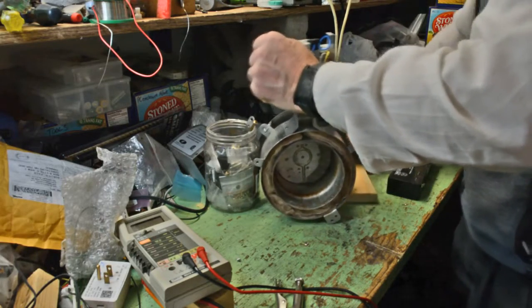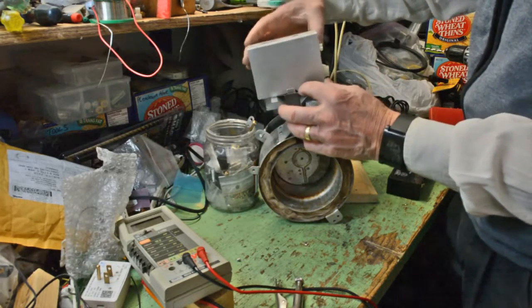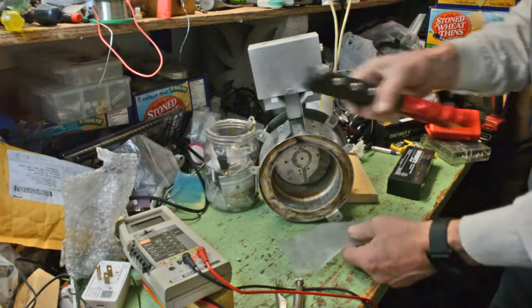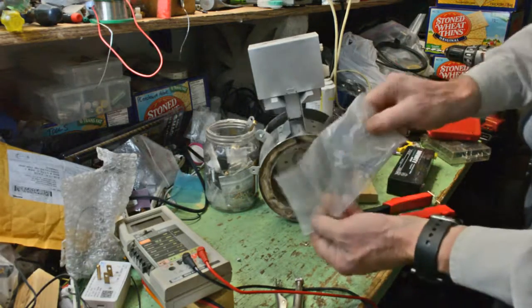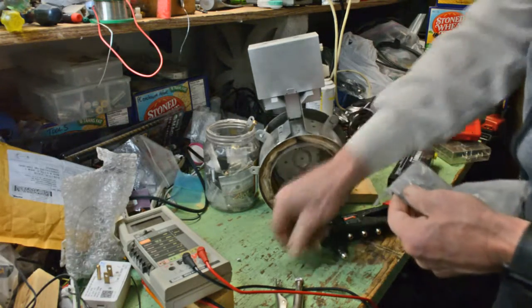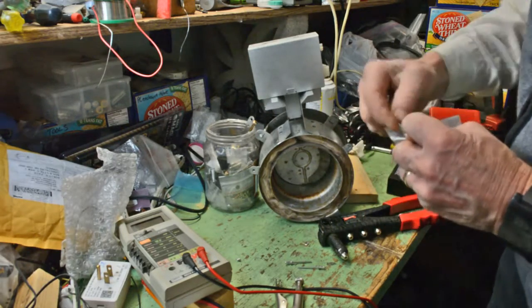See the 3 mounting tabs where it fastens to the top of the water heater. So I'm going to slide that on, make sure the tab is outside the cover itself. Pop rivets, I believe they're 1/8 diameter, maybe 3/16 grip range, whatever you want to call it. There's only two thin layers of maybe 28 gauge steel to hold together, so the grip range doesn't have to be great.